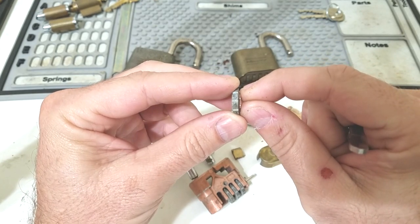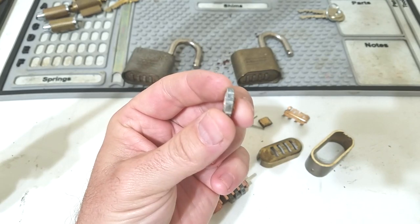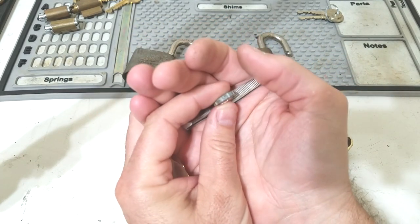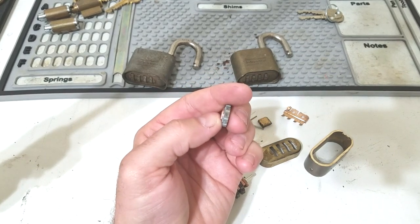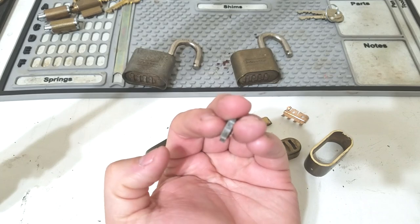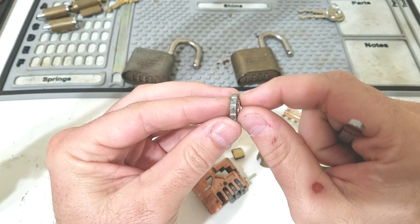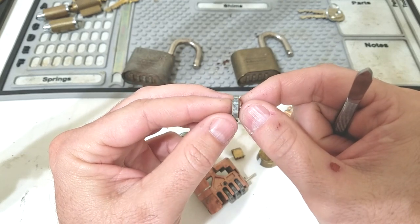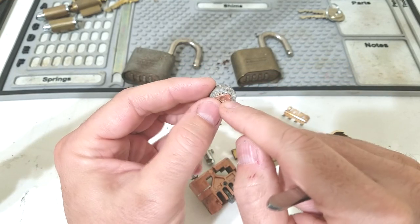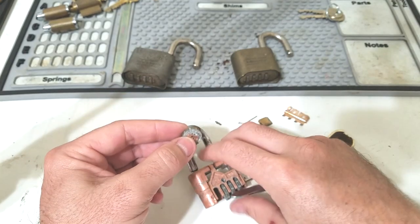You find which two numbers the gate is between — they'd be oriented straight up — and in this case you'd roll it down to the five, then rotate it two whole numbers. What you're doing is orienting the small groove to the very bottom and orienting the flat spot to the very top. Now the reason that's important — let's take the rest of these wheels out. All these wheels are identical, so it's not important to go over them all.